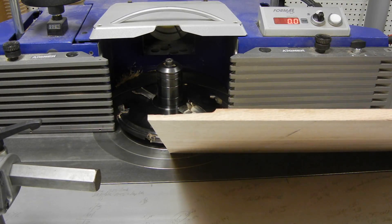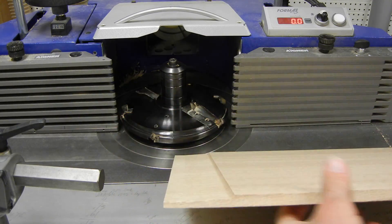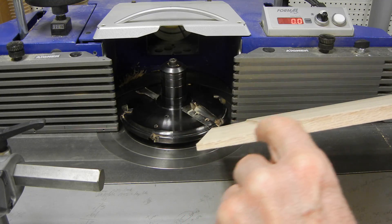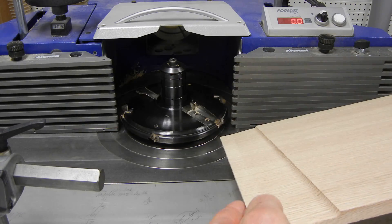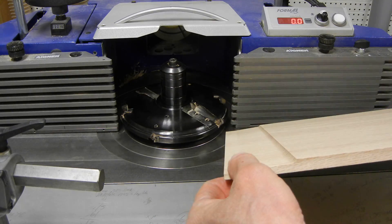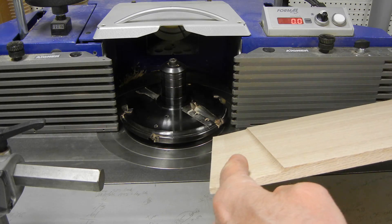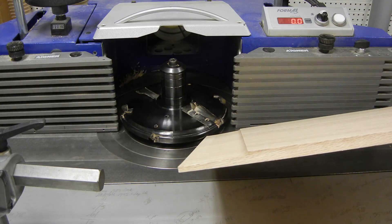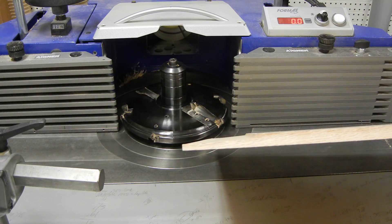There's our profile. We're ending up with right around five and a half millimeters for where this part fits in the groove. So we have the profile with a radius, then a sloping shoulder on down, and then about 20 millimeters from the end there's a flattening out where the lip section of the profile is flat. You can make it less than the 60 millimeter total cutting length I have here, but that would not give you a flat edge that sits comfortably in the groove and the rail and stile of these doors.